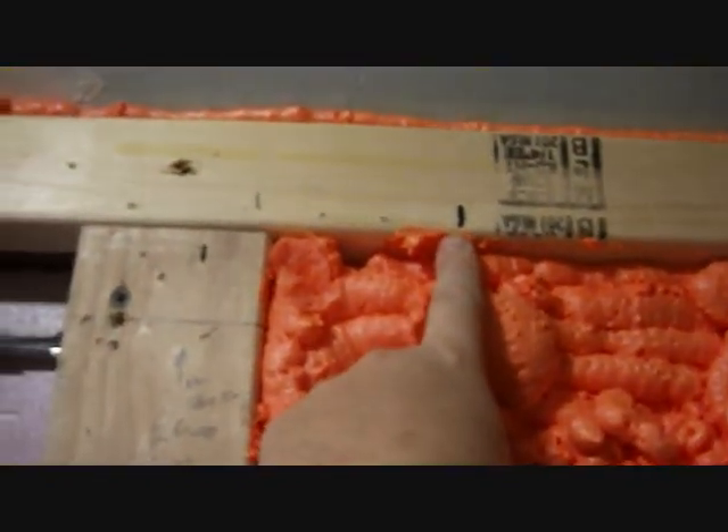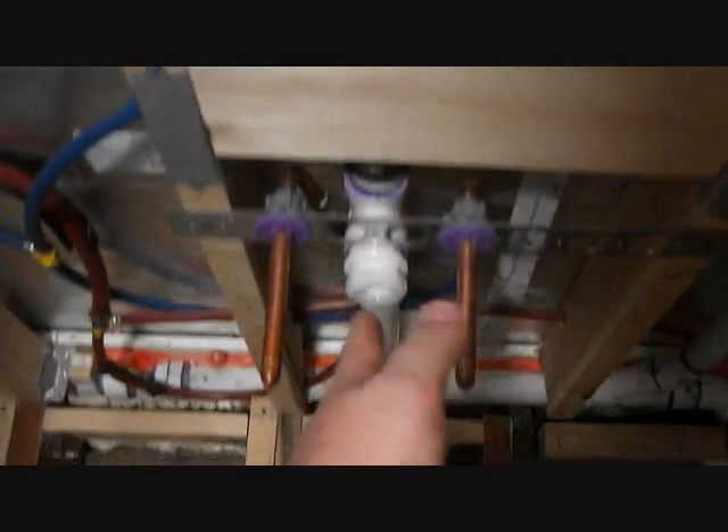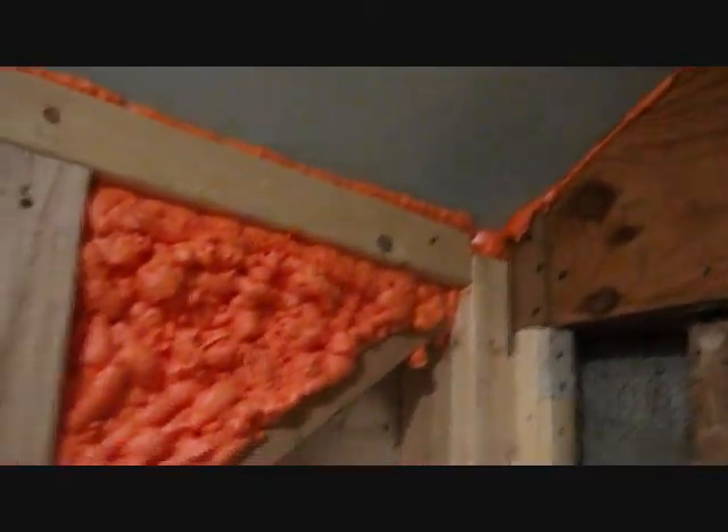This mark right here is where the shower stall ends. The center line of the drain versus the center line of this stud bay is about an inch and a half off. So the center line of a mirror — we can move the mirror over so it's on this center line, but then you have the extension jamb here and a molding, with the drywall coming up to there. There could be some offset, it could look stupid, but this room is so screwed up dimensionally — it just never ends.